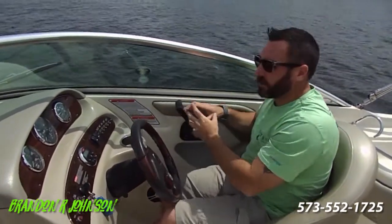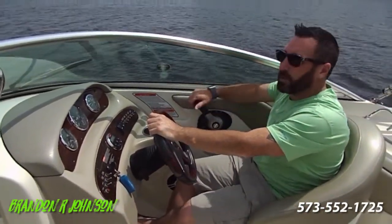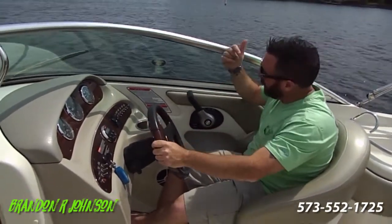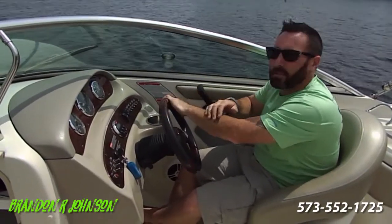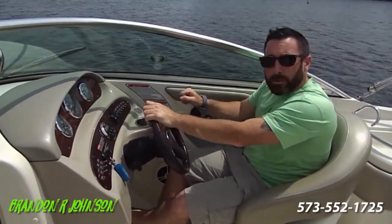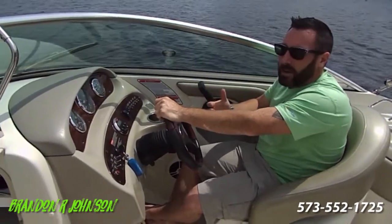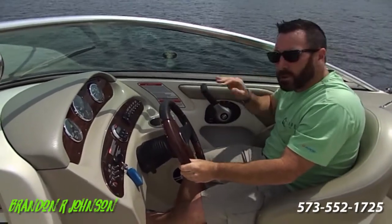In terms of tilt and trim, I'm going to include another video in the description that explains how to operate tilt and trim. When you're boating you want it down; when you're cruising or want to go fast, you trim it up. For the purpose of driving this boat on the water, I'm going to take the camera from Billy and go full speed, full throttle, so you know how the boat runs under a load. It's very important to do that. Then I'm going to trim up — when I trim up, the out drive's going to release the whole boat and we're going to go a lot faster. I want to push the boat to the limits so you know it's very strong and tight mechanically.